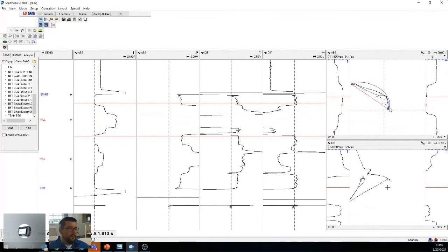So what's going on here is you have a long defect and your entire probe fits inside that defect. This is when you have the coil and the pickup coils in the defect. The exciter is still out. Okay, so this is the first leg.